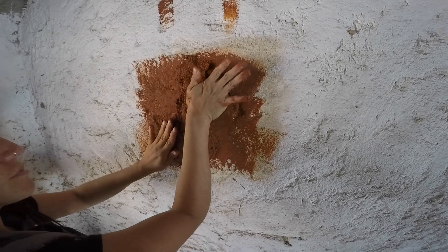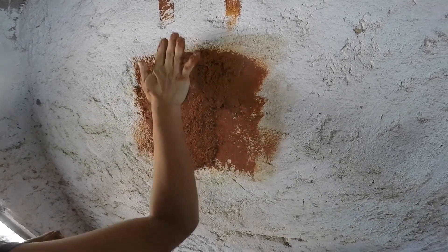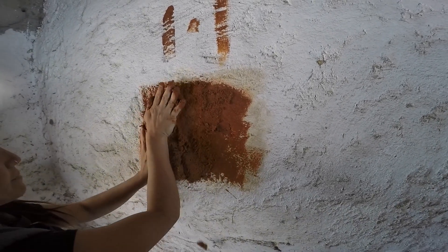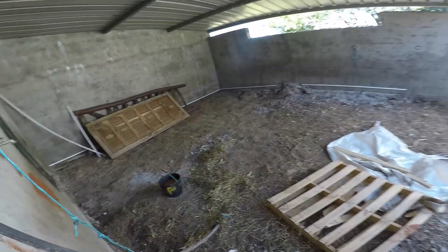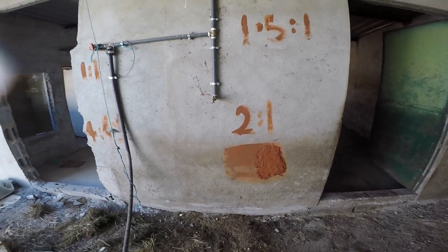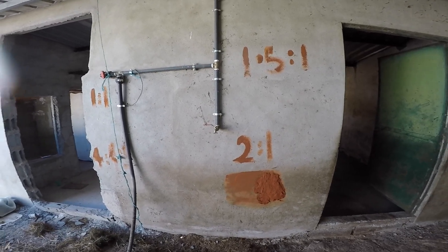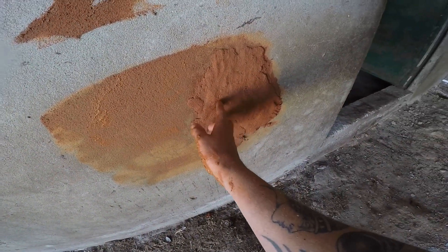Make the first application by hand or with a tool, pushing it really hard into the wall. It looks like it's sticking even though it's on paint, which we didn't expect — which is why we do tests on everything. We've got three different types of wall here, doing tests on each one. We mark out which one is which, and then it's exactly the same process for each: a bit of water first so the wall isn't so dry that it sucks all the water out of the mix, then the clay slip, and then the plaster.